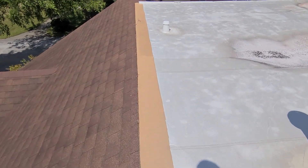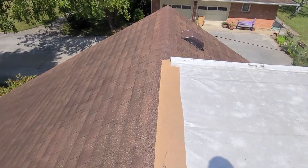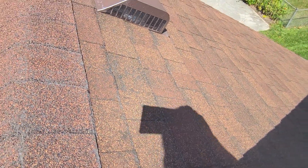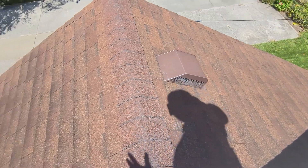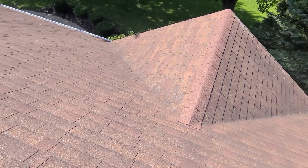Let's move to the shingles section of it. It's not as bad as the flat part, but I'm going to show you some things that really indicate shingle failure. If you look at this — and hopefully my phone's going to illustrate it — we've really got some granular erosion. And as I zoom in here, when you see all that white stuff coming through there, that's the shingles' cry for help. That is the fiberglass mat. The fiberglass mat is like the bones of the shingles — it gives you the structure, the integrity, the memory, and all that kind of stuff so it doesn't slide off your roof.